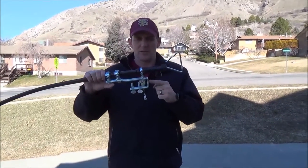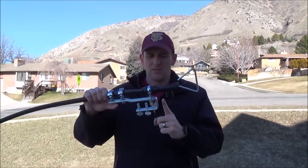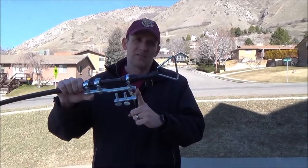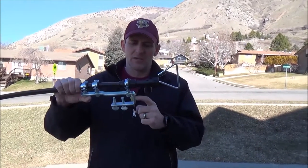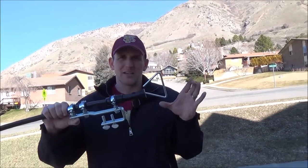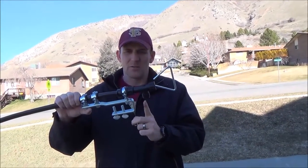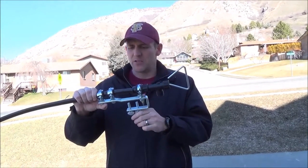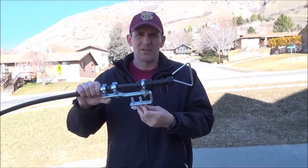When you measure, you want to do your measurement from the well clamp down. If you're going to do 40 feet or whatever, measure from this part down because the spout is going to be sticking up over. This is the part that goes from the top of the well housing, so that's where you make your measurements from.